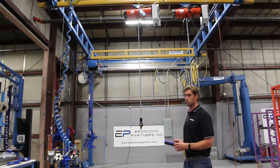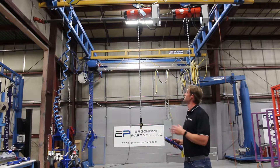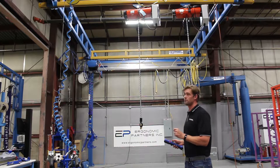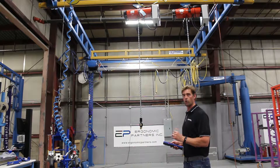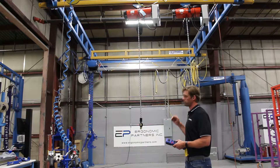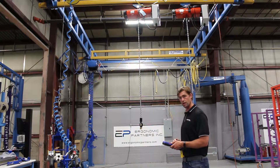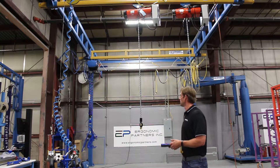For demonstration purposes I just set this up on one hoist on one crane. The cool thing about this is it's a single phase 110 volt hoist that has an encoder on the motor, and you can program virtual limits — essentially virtual stop points — into this system. Through the CAN programming on the radio receiver, you can talk to the encoder on the hoist. In this case we've set it up for three limits: a high set point, a low set point, and a medium set point.